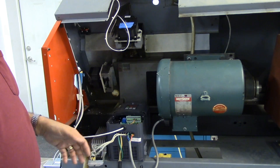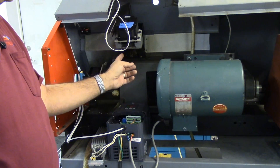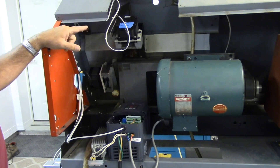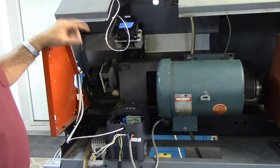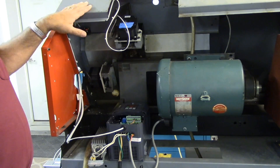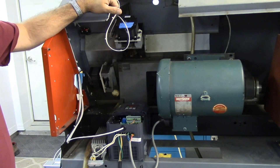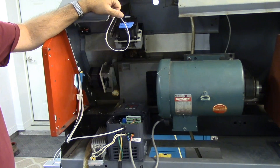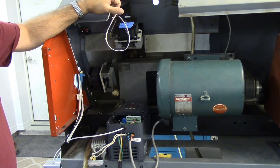This machine uses grease fittings to lube it. It's an EMCO Turn 120 — not the P model. The P model had a pneumatic tailstock and central lubrication. So this is the bottom of the line, if you will, but still quite a capable machine for prototyping and limited production use.